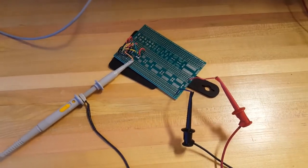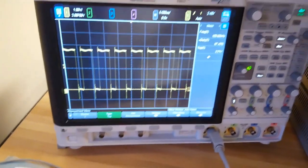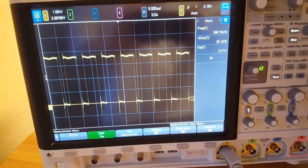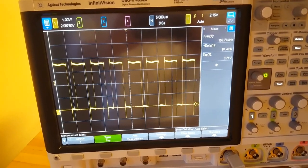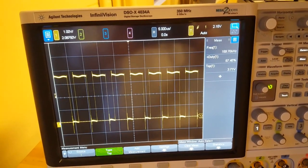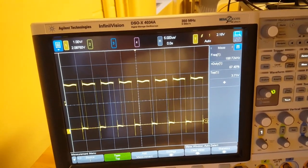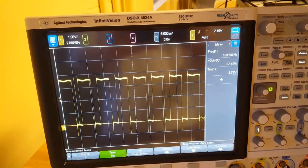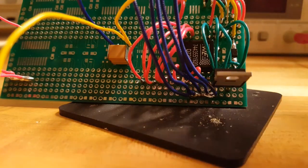In the previous report, we calculated that we would need 100 kHz and 70% duty cycle. As the TI pointed out, the ripple would be too high in the case where our bicycle LEDs are off, so we've increased the frequency to 160 kHz, as you can see here. The duty cycle is 67%, and we'll see if that's good enough when we test out the rest of the system. Next, we build our boost converter, as you can see here.